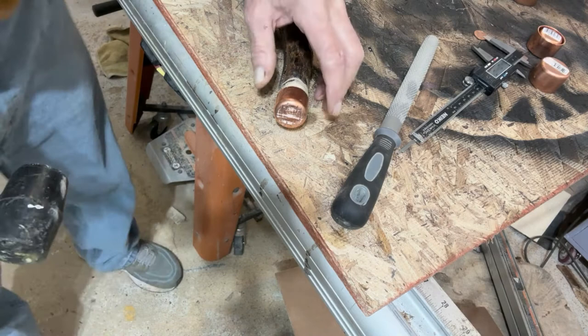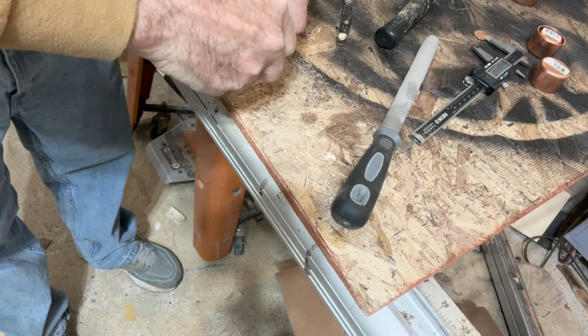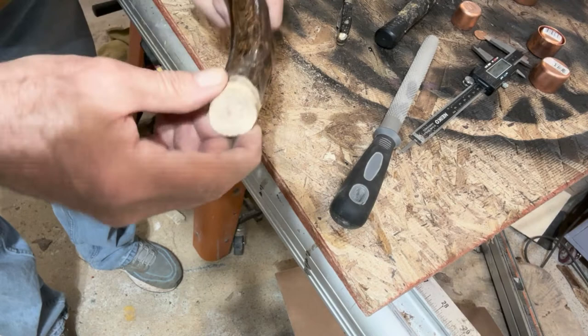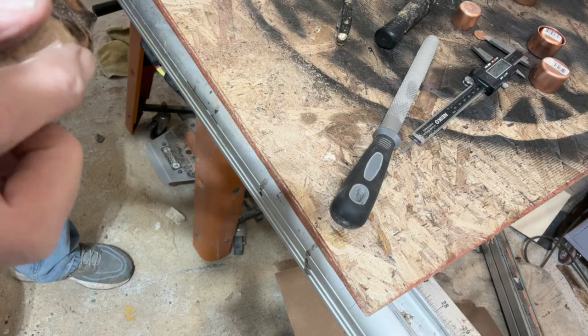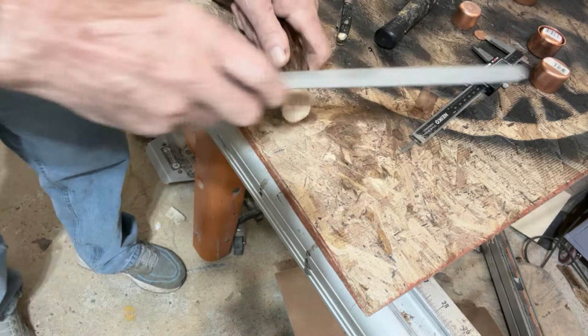Now I've got it close. I'll hold the fitting in my hand and tap it lightly with a mallet to see how it's going on. It's driving on there right now — if it were fitting evenly all the way down we could pound it right on. But looking at the end, you can see there's a little more that has to come off right there. I can see that groove, so I'll take the rasp and knock that down to get a perfectly round surface.